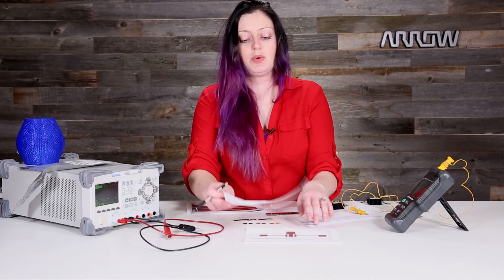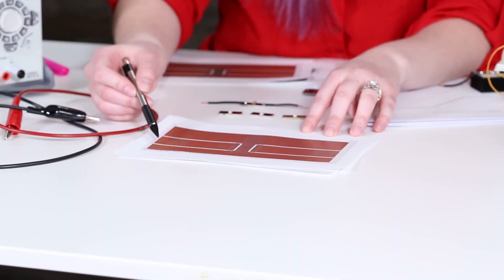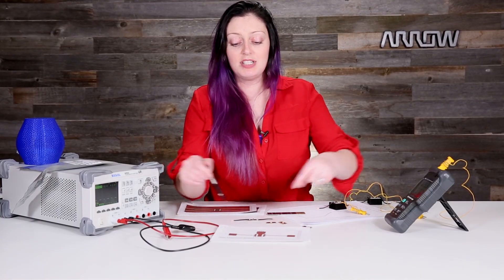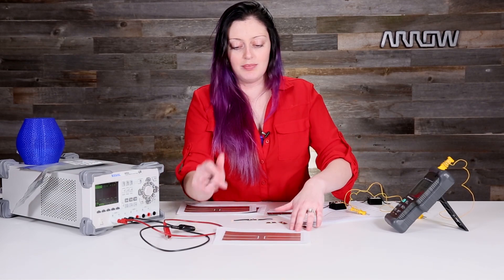The way you might be doing it if you don't have any drills is what I've called copper relief. You use nice big traces, fill pad to pad on power and ground, and then use all the remaining copper to thermally relieve your LED. This is how you should definitely be doing it at a bare minimum, because PCB etching is actually a removal technique — they're etching out the copper where you don't want it. So when you make somebody do something like this, they have to take away all that extra copper. You're not doing anyone any favors. So at a minimum, this is what you want to do.